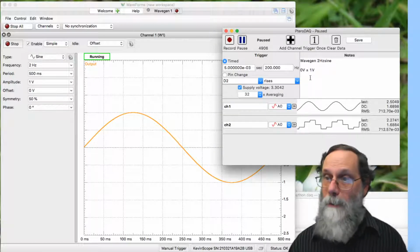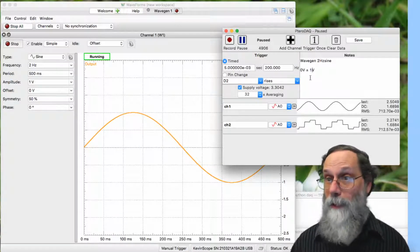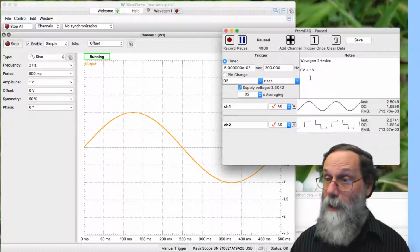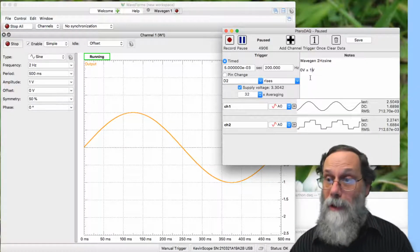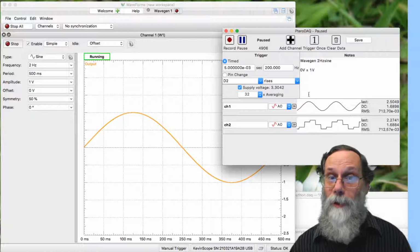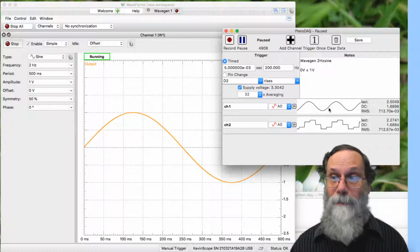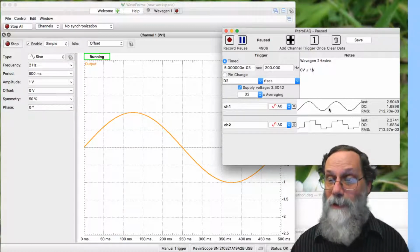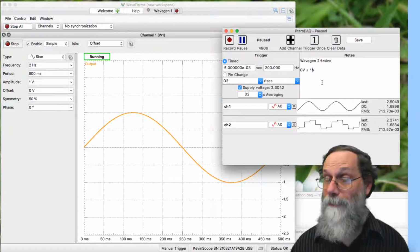And you can play around a little bit, make sure that your filter is working. You might want to check to see how low a frequency you can go down to before it stops working. Play around with it a little bit. Make careful records of what it is you're recording here, because if the filter's working, when you look at the output of the filter, you can't tell what the input DC offset was. That's being blocked. So you have to record it manually.